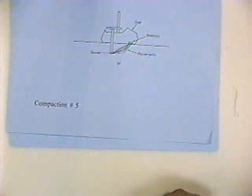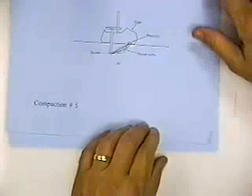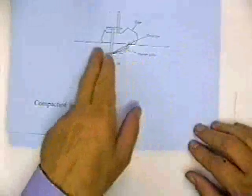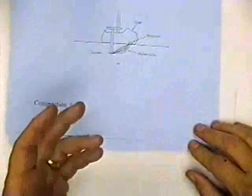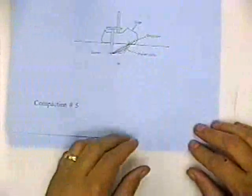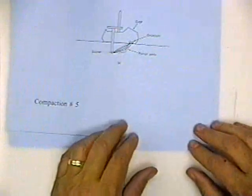If you end up with an air gap in there and you don't know the dimensions of that air gap, you get some serious errors. You also have to correct for geometry. If this is in the bottom of a trench, you get different results, and you've got to make a geometry correction.